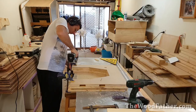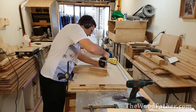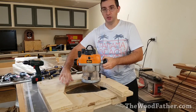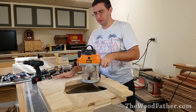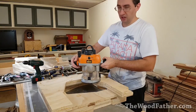So the next step of my frame building plan calls for the MDF template to be screwed into the C-frames, and then I've got a flush trim bit in the router which is going to run along the MDF template. I'll be able to cut out the insides of the C-shape nice and flush. The outsides I'm not too worried about because they're already square, but the insides I won't be able to sand them easily, so the router is going to make short work of it — hopefully.